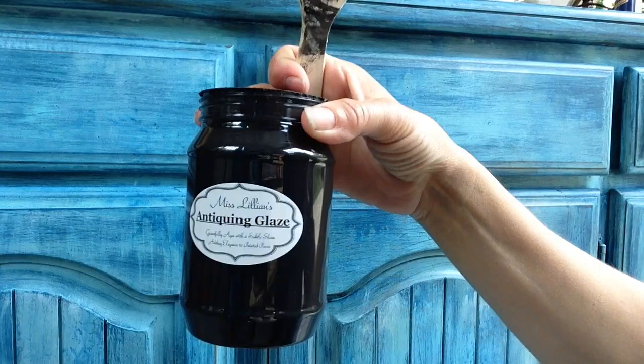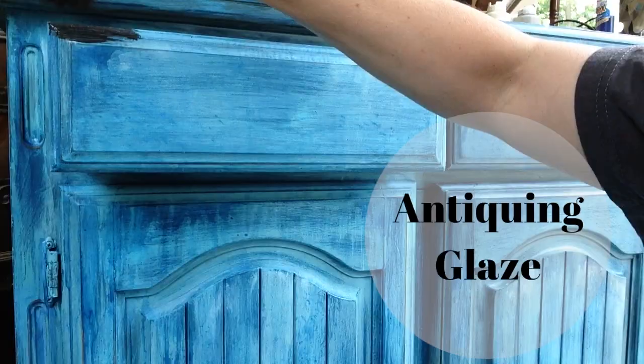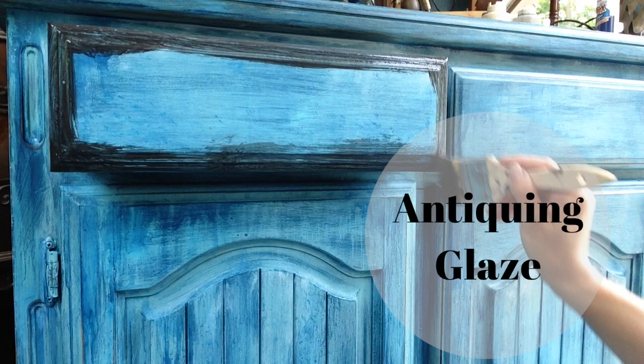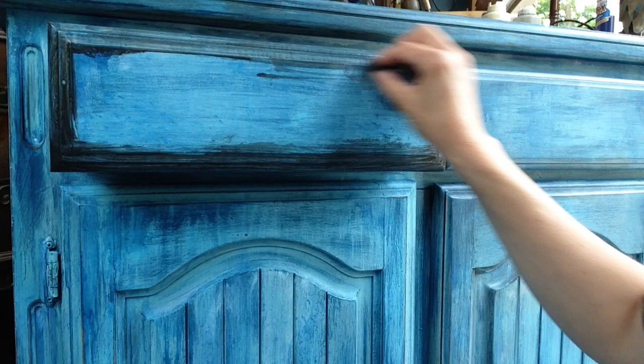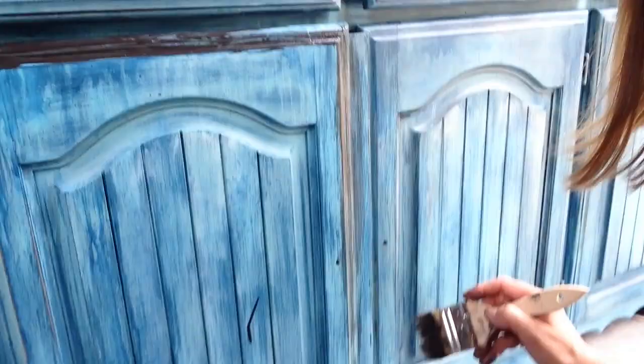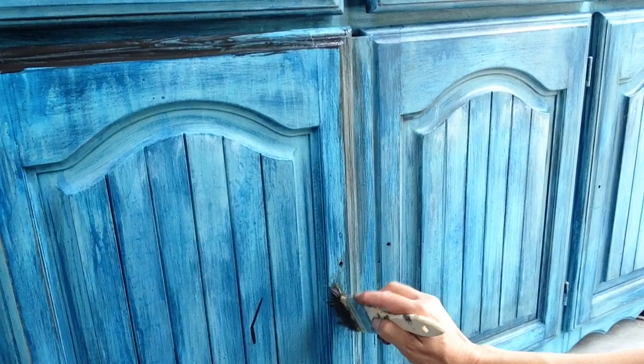To add just a little bit of aging to my piece I'm using the Antiquing Glaze in Black Walnut. I'm really concentrating just on the edges — I apply it and then wipe it back with a very fancy tool, which is an old sock, and just kind of feather in those places where I have a hard line. You never want to have a hard line when you're using colored waxes or colored glazes, so just feather things in using a circular motion or keep wiping back until you get a nice soft fade with your glaze.